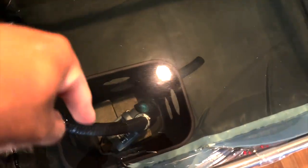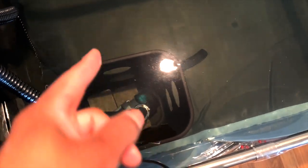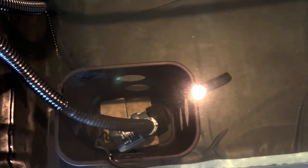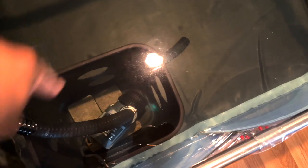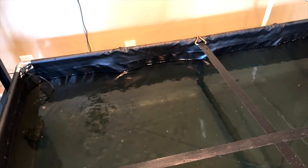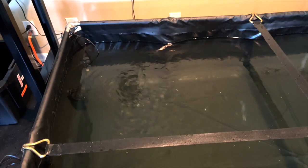I took my pump and put it inside a trash can. I drilled seven or eight holes in the side of the trash can. The reason is I've heard stories of ponds draining too low and flooding the floor — and this is 500 gallons, so that's a lot of water. I'm also placing bricks at the bottom to raise the pump above a certain level, so if something happens while I'm not here, it won't dump 500 gallons on the ground. There's also some gunk at the bottom I need to clean up.